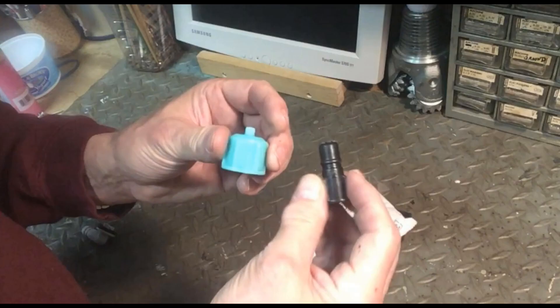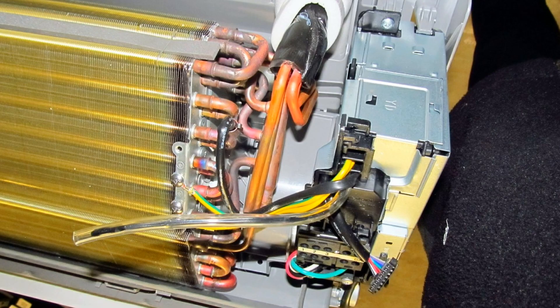Here's a correction to the video. At 6 minutes 44 seconds, I meant to say that these caps went on the end of the copper pipe sticking out of the back of the inside unit. I should not have said on the line set. There is nothing at all in the line set in the non-do-it-yourself models. The inside unit is charged with nitrogen for protection. You can tell if your inside unit has leaked when you take the caps off. Then the lines must be vacuumed out before releasing the R410A in the outside unit. The refrigerant then flows through your vacuumed-out evaporator and when you open the valves on the main unit, it goes through the rest of the system.